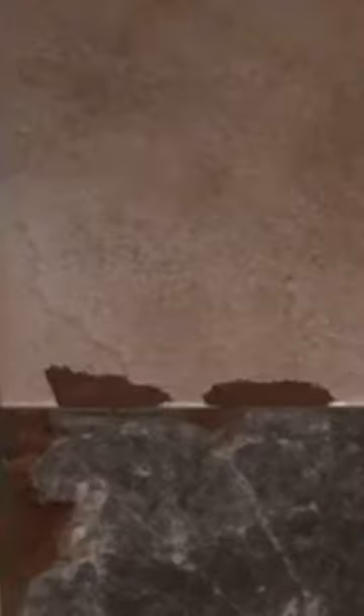This is a perfect project to put my new roto razor saw to the test. As you can see, some of the good tiles are chipped on the edges, and I can only guess that maybe this is why he didn't come back. When doing a repair like this, it's always best to remove the grout between the good and the bad tiles. If you don't, you can easily break or chip the tile beside it, just like this.